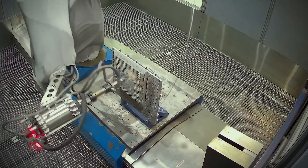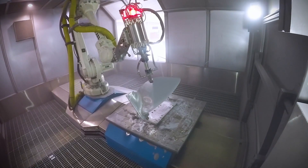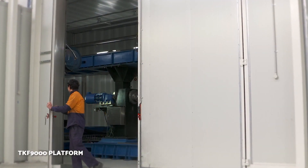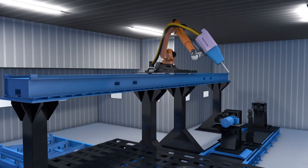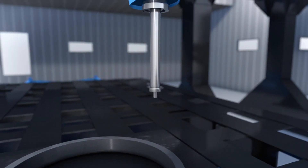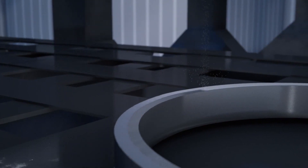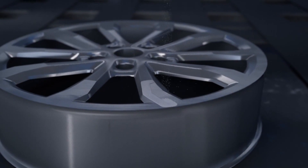With TKF, we've delivered the world's first and only industrial-scale metal additive manufacturing process, enabling the manufacture of lighter, stronger and higher-performing metal components, faster and smarter than ever before. The TITOMIC Kinetic Fusion process begins by feeding metal powder particles, 5 to 105 microns in diameter, into a stream of supersonic gas, accelerating them towards the substrate. The particles impact the substrate at such high velocity and with immense kinetic energy that, as they collide, they plastically deform and mechanically bond with the surface.